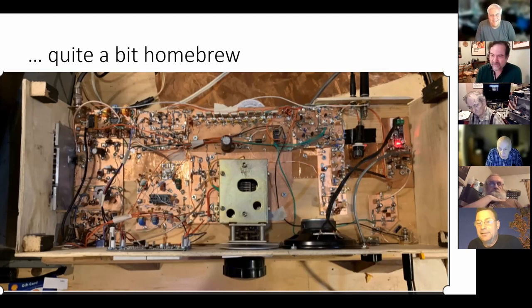And that's how I adjusted the location. Now, believe me, there are better ways to do this. But that's essentially what I was doing. I was moving the carrier oscillator in relation to the unmovable passband of that crystal filter.